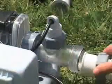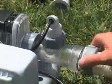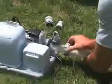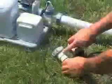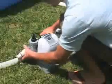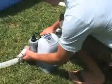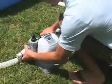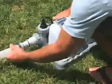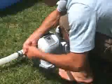Connect the 1 1/2 inch diameter short hose that came with the saltwater system to the inlet side of the saltwater system marked with the water flow arrow. Now, locate the 2 hose adapters, A and B. Connect adapter A to the outlet end of the saltwater system closest to the copper electrode and tighten securely. Clamp the water return hose to the adapter with a hose clamp.